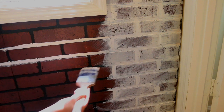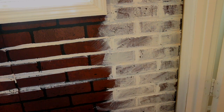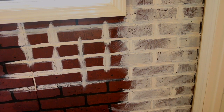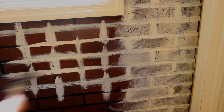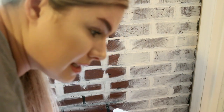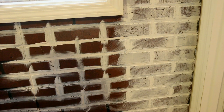I found it works a lot better if you do the grout lines first, and it does not have to be perfect. You just kind of paint through it and smear it around everywhere. It's super simple and super easy. Literally, this is probably one of the easiest projects to do — don't be doing all that German smear business where you stick all this compound on here. Just use paint. It works so easy, so simple, and honestly pretty cheap.